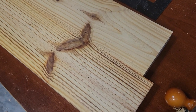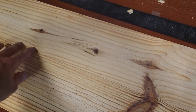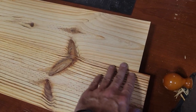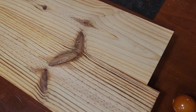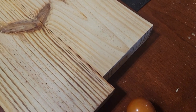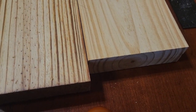As much as I tried to get these perfect, they're not perfect. When I dowel them together and glue them, I'll actually be able to run this through the planer as well, and I think just one pass will even out any of the imperfections that are in these tops, then I could just sand the rest of it out. But we put them on our table saw jig or guide to get them really close. What happens is this angle is not always exactly perfect.